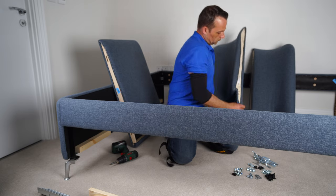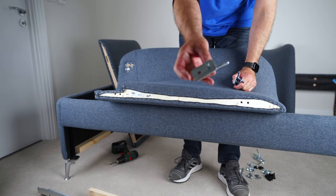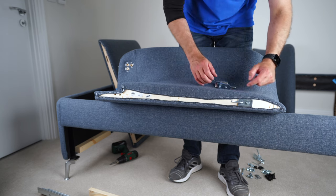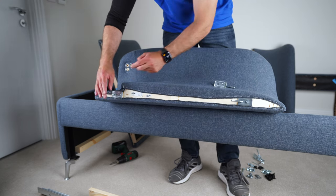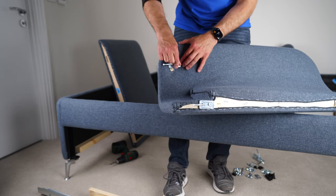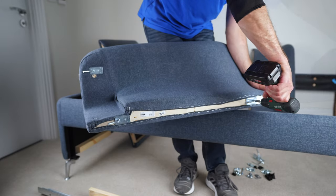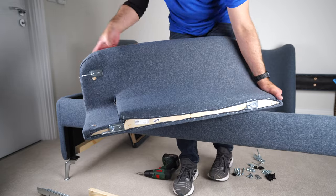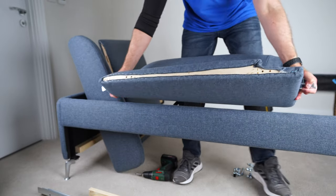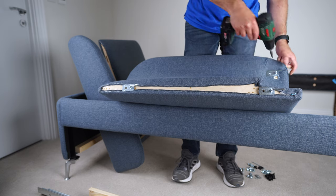Now we're going to have the curved panel — it has holes in there. Put those brackets exactly the same into those holes, with the pointy parts pointing down, as the down part is where the headboard is going to be attached. Place it in and secure with one screw. One more goes into the curved part — so two on the edges and one in the curved part. Exactly the same on the other curved one: two on the edges and one in the curved part, three brackets total. Pointy part pointing down. Secure each with one screw and make sure all the screws are attached completely.